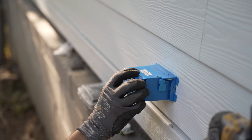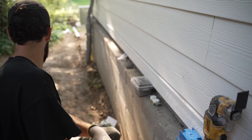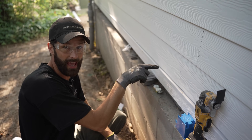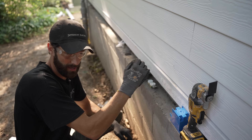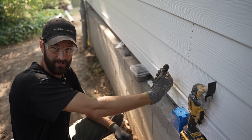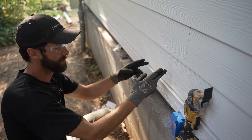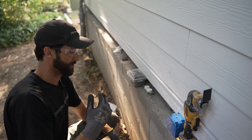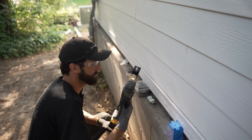Before I cut that box in, I have to know with certainty where the studs are. If I didn't know, what I could do is take a couple more pilot holes at varying angles to find out where those studs are. I'd keep a real small hole in the exterior. If I had a finished interior, I could poke small holes until I found where those studs were, and accommodate by shifting the box left, right, up or down depending on what I found. Let's go ahead and cut this box in.